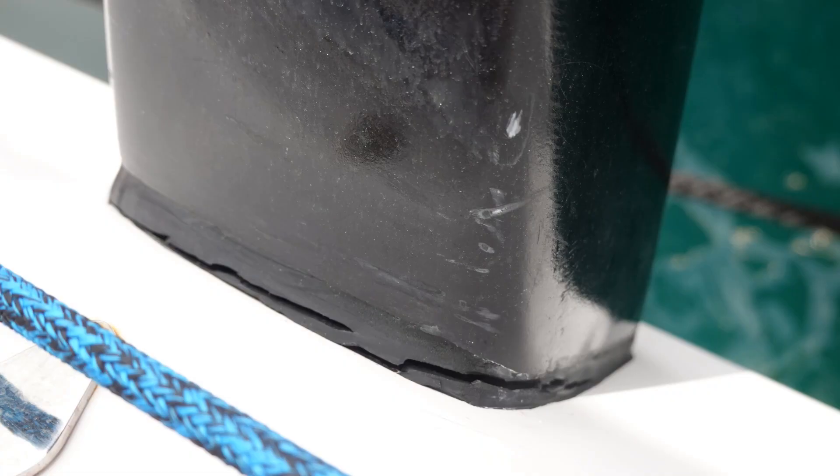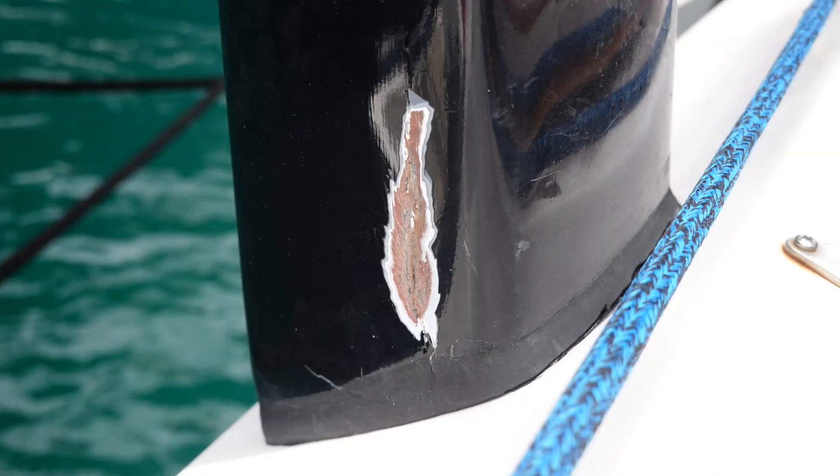When we left Rhode Island and sailed to Antigua, the Gulf Stream crossing was pretty rough. We did have a rough sail for a few days and when we arrived in Antigua we noticed some cracking around the davits. Pierre tested it and it looked pretty strong — it wasn't a danger to lose the dinghy — but we wanted to have it checked out at the same time. The cracking around the Sikaflex was just at the Sikaflex, but they did open it up and saw a crack in the carbon fiber, and that was repaired as well.